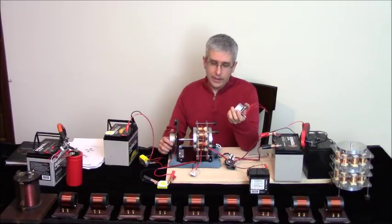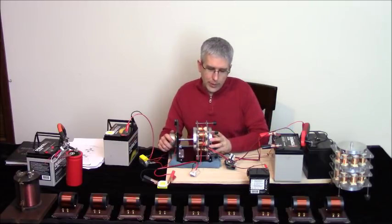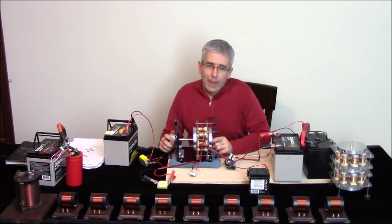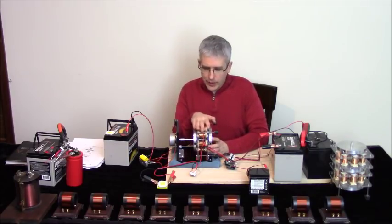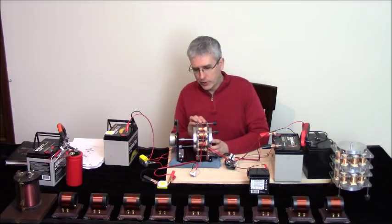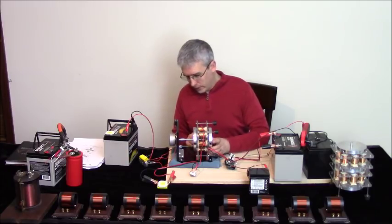And that's why I was saying this is like a 400 watt motor if we go up to 48 volts. Of course, as you raise the voltage, the amperage is going to draw more too if you have a big enough load. But I'm going to limit that recommendation, you know, to not take this too hard. You're really going to have to hold this frame down, and if you're going to push it to those extremes, you might want to drill out the holes and put bigger frame bolts and so forth.